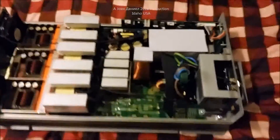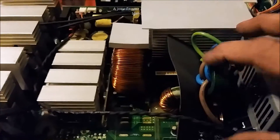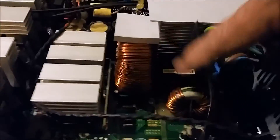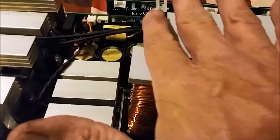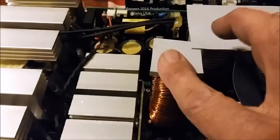The Mean Well is drastically different. To get rid of any kind of noise or feedback in the electricity, all the wires go through a choke. All your 110-volt output gets conditioned and has a complete conditioned circuit. This is a heat-sink material here — it's vibration-resistant, which keeps it from knocking around like you see in some inverters where their toroids come loose.